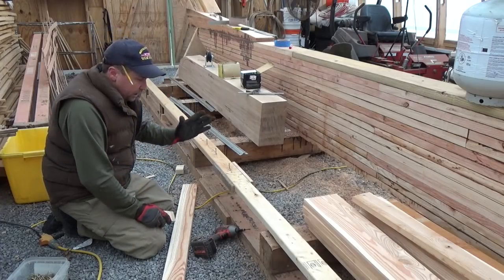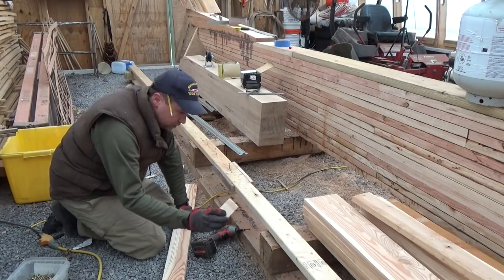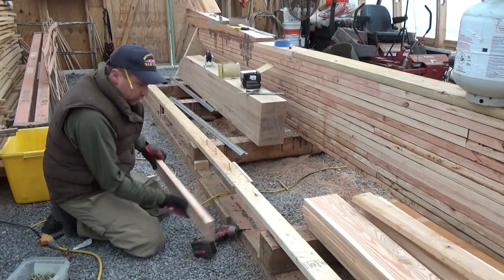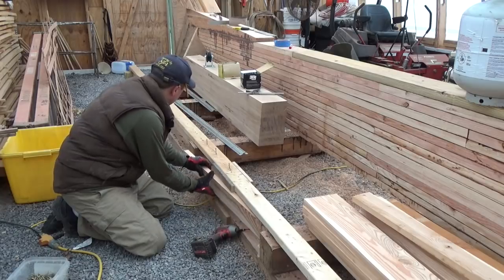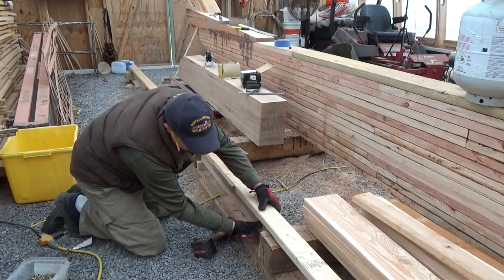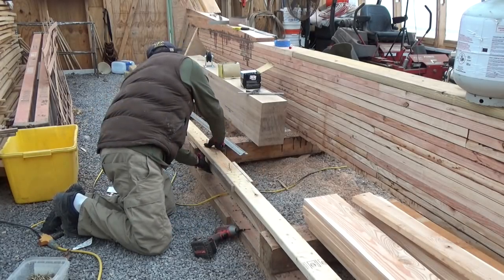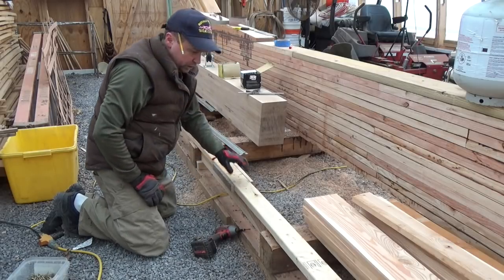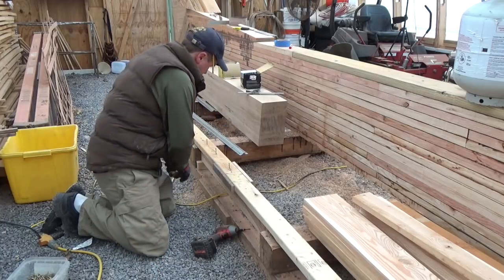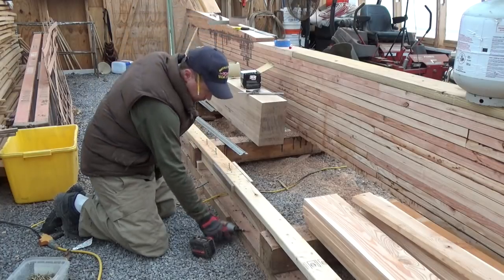What we're doing is trying to stiffen up this track for our rolling gantry crane. I'm just cutting some 2-inch blocks. It's kind of a ledger. And then we're putting our homemade 2x4s in, and then we drive it through with a couple screws. That's it. I'm using a couple 3-inch screws to hold things in place, and then I'm running through some shorter 2-inchers just to stiffen it up. Now, if we wanted it really stiff and really super permanent, I would glue it, but we're not going to be doing that.